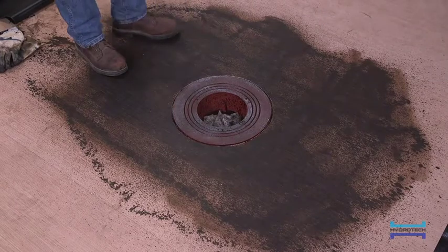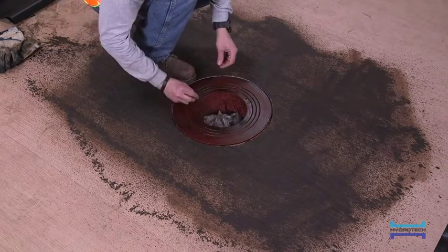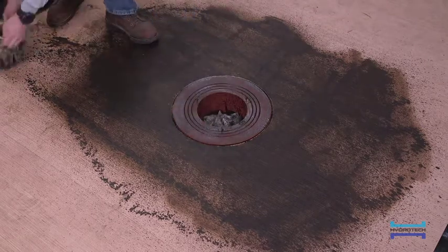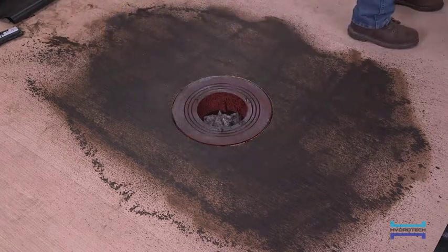When the clamping ring fasteners are not separate threaded rods and nuts, it is advisable to mark the location of the fastener holes in the drain's deck flange before continuing. Screws or nails can be fit into the holes so that the holes can be located later when installing the clamping ring.